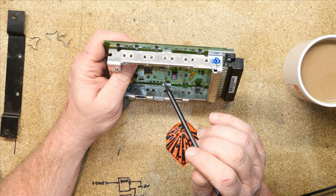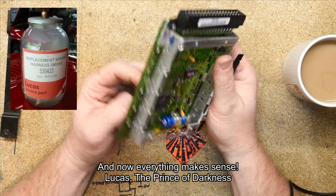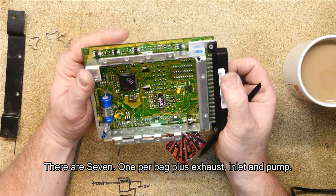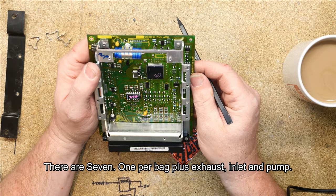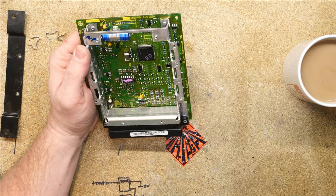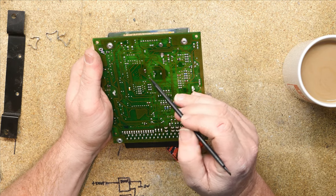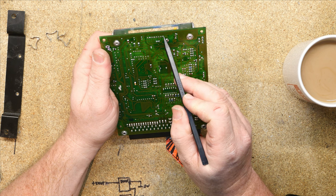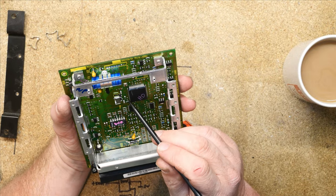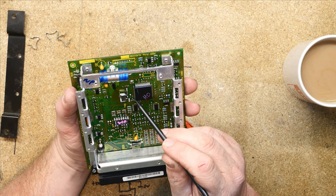Just noticed something — this is all badged up as Land Rover and Dunlop, and yet it says Lucas on the inside. We also have what look like power transistors. I need to refresh my memory on just how many solenoid valves there are in this pack. I believe this is a very basic 6800-based micro. And we do appear to have a programming connector on here. Interestingly, the diagnostics output of this is RS-232 serial — nothing special. I'm willing to bet this is a programming and diagnostics header, with four pins going direct to the microcontroller.